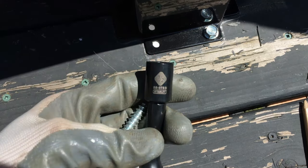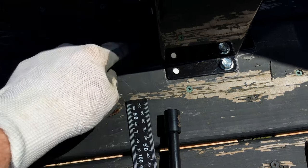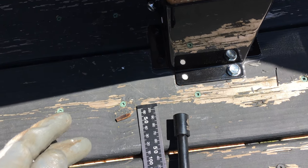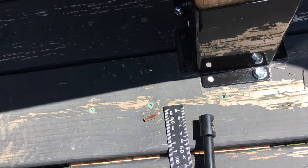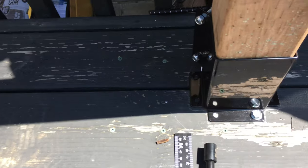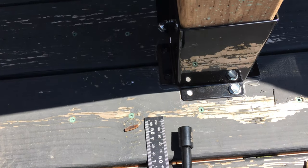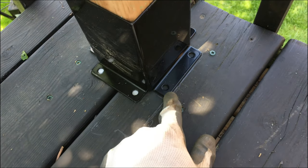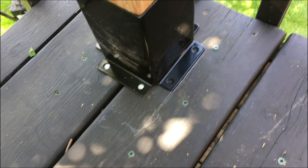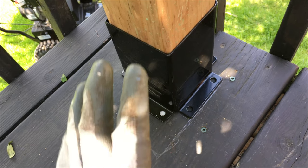In this case we're okay, so we'll just go ahead and put our screws in. I'm placing one screw and then two on the back — that's it for now. Things might need adjusting, so as a test we're just putting two screws in at each post. We'll do all four posts this way, then do the final tightening once everything's up. Quick tip: always mark where you're placing the post so if it moves during screwing you'll notice, and check that everything's level.